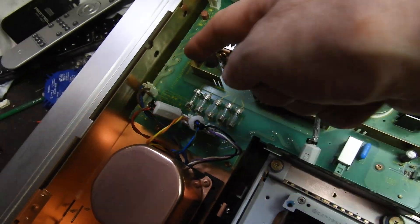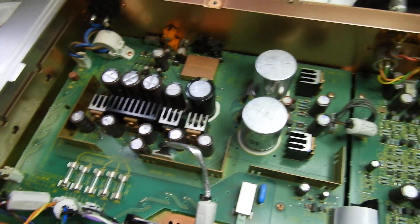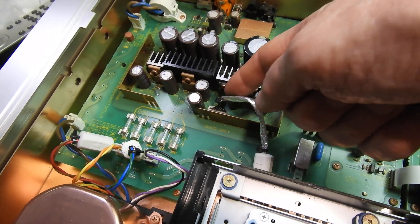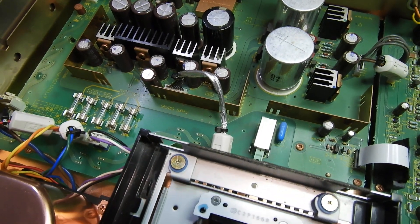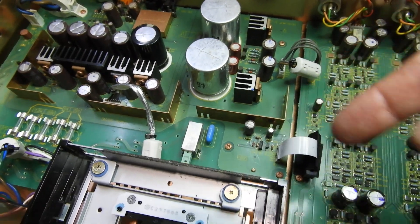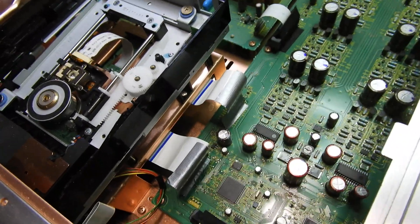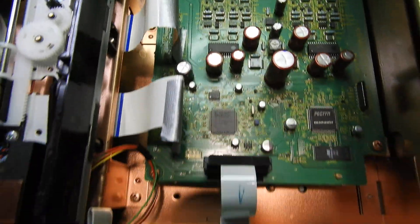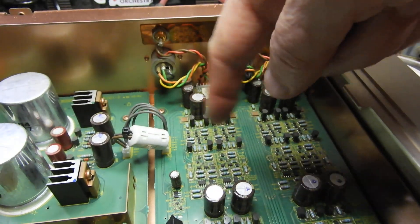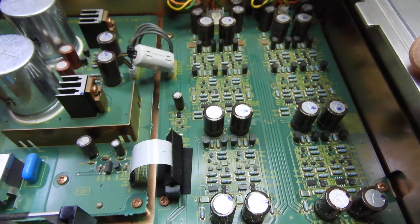The transformer sits in a Faraday cage. There are fuses for everything — a main one and separate fuses for each rail. I can see two, four, six, eight regulators, and all the capacitors are ELNA — nice touches. There's screening over the cable running over the power supply so it doesn't pick up noise, chokes and filters on the cables, and gaffer tape used to prevent cables from slipping out of connectors. The board layout is very clean, and the output stage uses all discrete components — no op-amps — with big power transistors, though my eyesight isn't great at 4am.